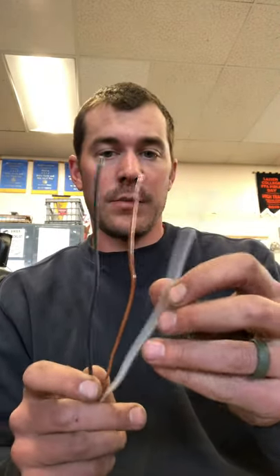Good morning. For today's lesson I was looking to do some very basic material regarding how to make pigtails. Some of the first things you're going to get acquainted with, especially for this electrical unit, would be the type of wire or cable used for your electrical boards. These electrical boards will feature three different boxes, each connected by a 12/2 cable. These different cables are designated as either a 12/2 or a 12/3 cable. A 12/2 cable would have three different types of wires.